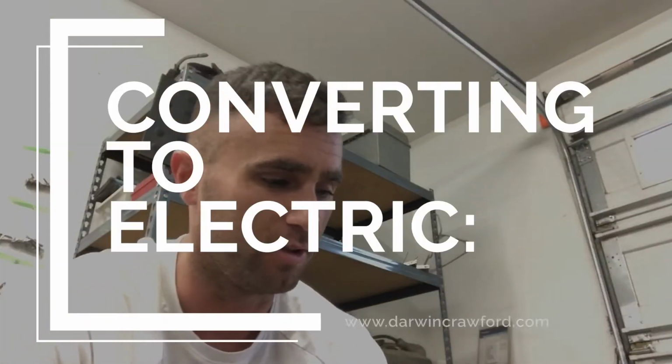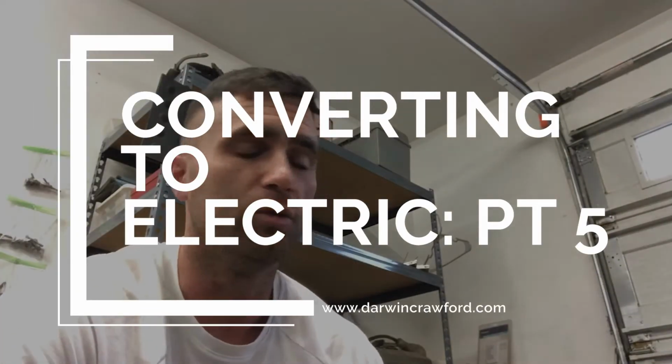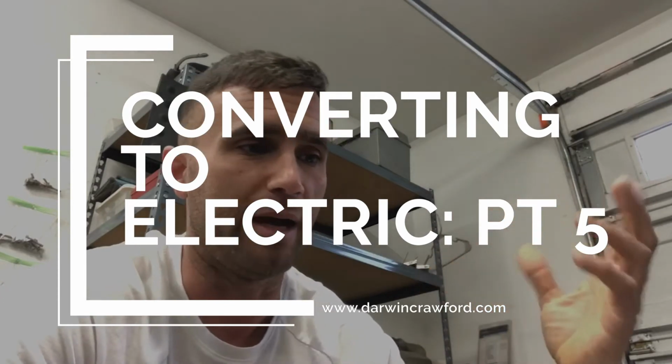I'll show you guys what's going on in just a second, but I was going over how I want to wire this battery bank for the cart because it has to be balanced, right? We got to balance all the cells. I need to be safe because I'm not using a battery management system, and with lithium ion, you can do that, but you just have to kind of play it safe. You can't run the pack at capacity, right? So if the pack's 112 amp hours, you might get 80% capacity and you're gonna be okay.